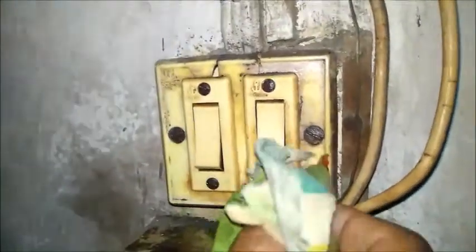See — this liquid has come down, kerosene and thinner have evaporated and brought the contamination down. Now I am wiping it with a clean dry rag. It is necessary that the cloth should not be conductive, otherwise it will add to the contamination. Be very careful — understand what you are doing first, and then do it at your own risk, or get an electrician to do it.